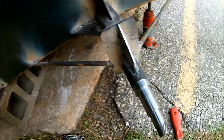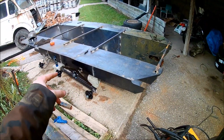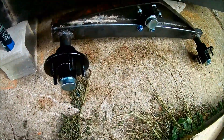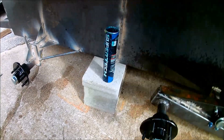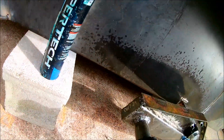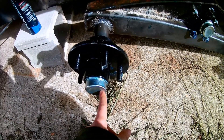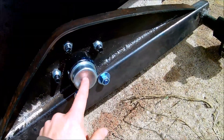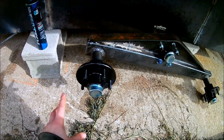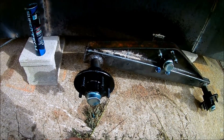I cleaned up all the grease seals and races, and I'm going to start assembling all the hubs and bearings, greasing them up. All the rolling elements have been installed on the chassis, all greased up and ready to go — walking beam mounted, roller hubs mounted. I used some Super Tech marine-grade grease just because of the nature of this thing — it's gonna be in the water a lot. Kind of don't like these little cheap Chinese grease caps; they always dent up on you no matter how careful you are.